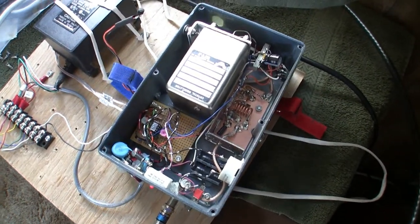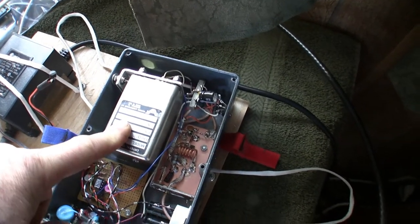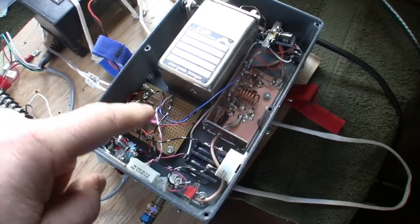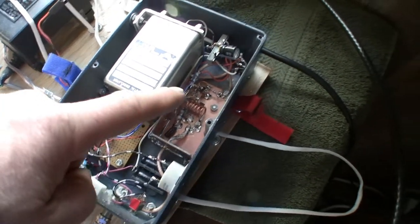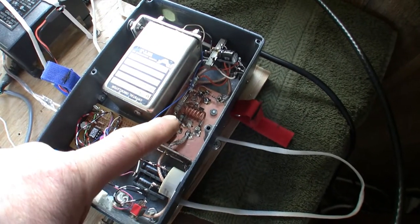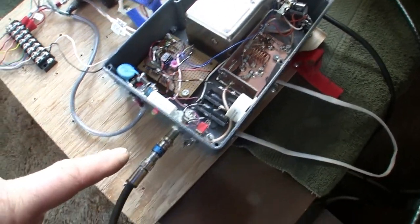There's the oven oscillator operating at 1/108 of the output frequency. There's a computer right there, and that's an amplifier that boosts the 96-ish MHz signal and sends it out the coax.